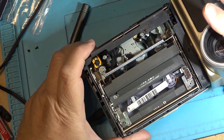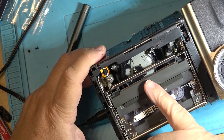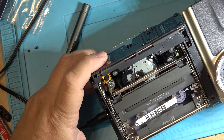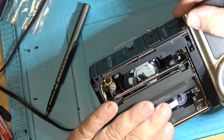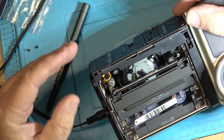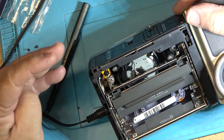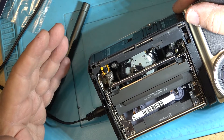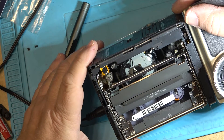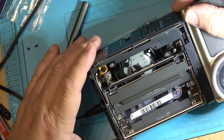This can sometimes be a very time-consuming process. It would be wonderful if you could just set it once and let the tape play, but that's not always the case. Sometimes you get lucky and can set it and get a full recovery. In the case of this particular client's tapes, one of them shifted constantly — I had to keep stopping, going back, resetting it, and picking up the recording again. In some cases it was so bad the sound was just cutting in and out, and there was some tape damage as well where the guide misalignment caused the tape edge to get chewed.